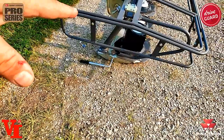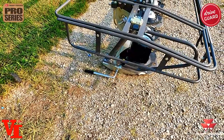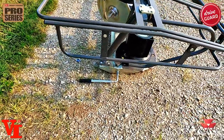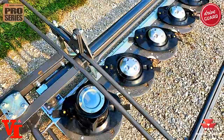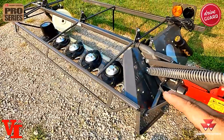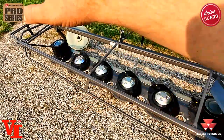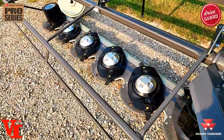This has lifetime lubricant and does not require checking, but you can raise this bar up — roughly seven inches as stated in the operator's manual — and if the oil flows out of this end, you're at the proper level. A lot of people like to check it once a year. The only time you need to change oil is if you have a failure of one of the compact angle drives. One of the features of the DM Pro series is a dual-piece cover system — a cover that covers the middle section, and one out on the end.